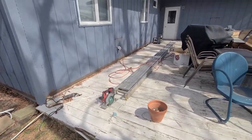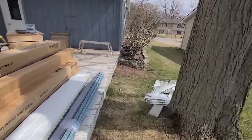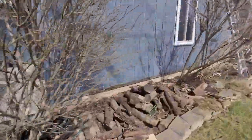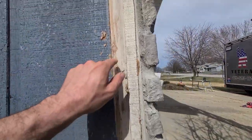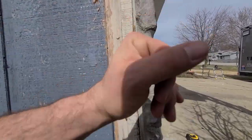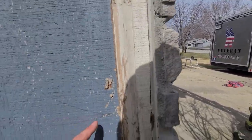Thankfully we were able to come through with a saw and chop off the bottom in a lot of places - pretty much all the way around this deck here. We came to the front too and you can see I've got this laser mark - we put the chalk line on it and I've got some squared marks over here. I set the laser up and pulled numbers from my laser line to continue this line across the front of the house.